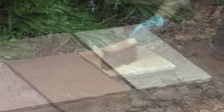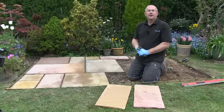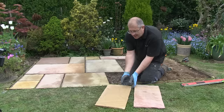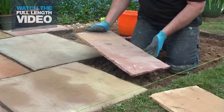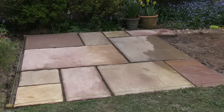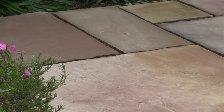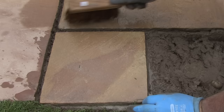Keep checking that the slabs are all level and that there are no obvious dips from one slab to the next. As I continue laying you'll see that I keep cleaning the pavement as I go, and it's really important to keep checking that the slabs are following the string lines. The joy of natural stone is there are no two slabs the same, however the colors can sometimes be very similar. My next slab would be this one but it creates a lot of yellow in this area, so I'm going to swap it and use this one instead - it's got lots of rosy pink tones. This is what we call color blending, and that will continue across this sandstone patio. If your project has more than one pack of paving, it's essential that you pick and lay paving from different packs to ensure colors are blended across the whole patio.